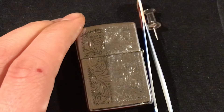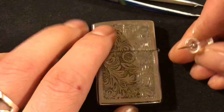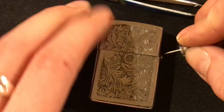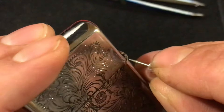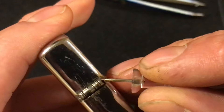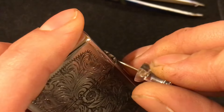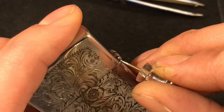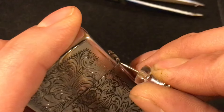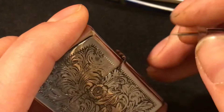I'm gonna bring you through the entire hinge and what's going on here. You're probably seeing YouTube videos where people change the pin on the Zippo using a nail, because it's got a pointy end that fits in that hole and can push the pin out far enough to grab it and pull it out the other side. The problem is the rest of the nail is wider than the hole, so you're widening the ring, putting extensive wear on it — bending it and bending it back — and it'll eventually break off.